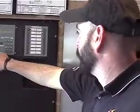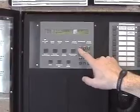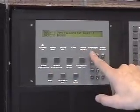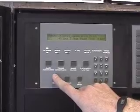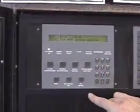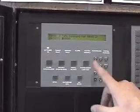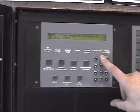You can also do any of the menu functions from here. Our level one password is 1-1-1-1. Walk test is a level one. We can change the clock options. If we need to check the log we can also go into the display — that's a level two, which is 2-2-2-2-2-2, and it will display log so we can go through any of our problems.